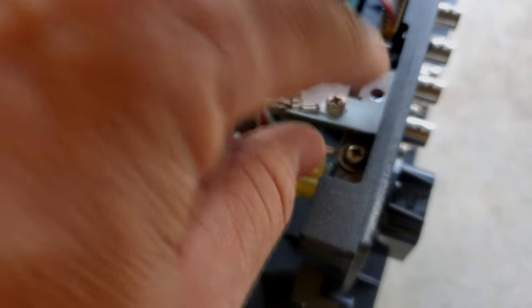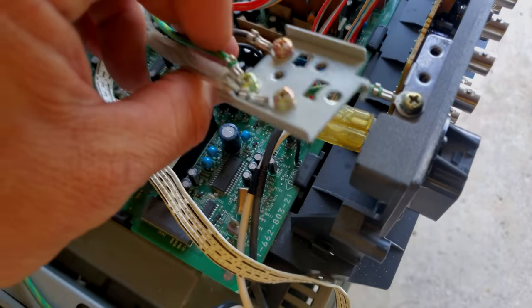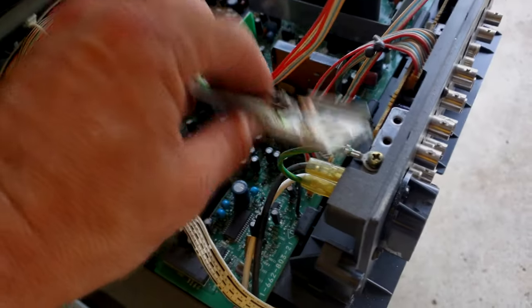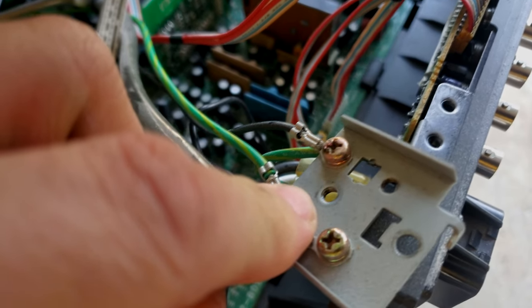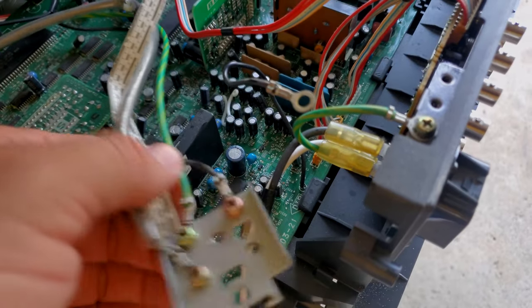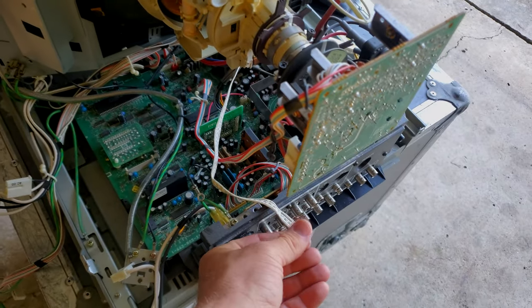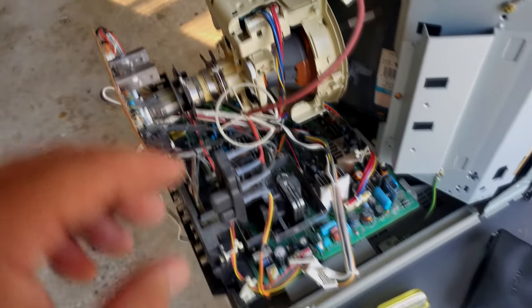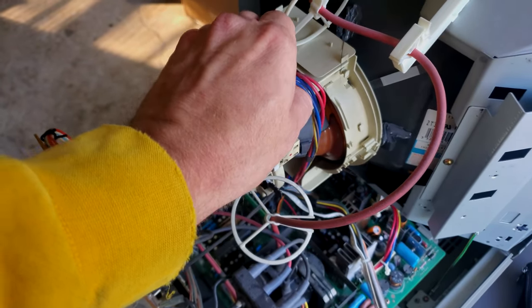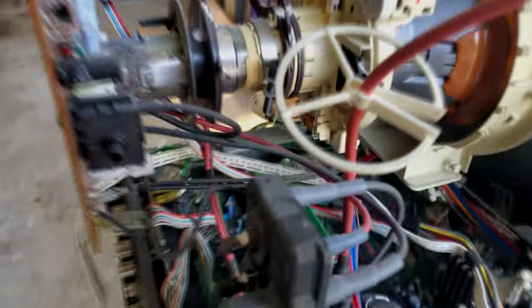Come over to this side and check out this grounding connection plate. There's one screw connecting that plate to the input board — you need to remove that so it's loose but stays with the tube. Then there's one ground point connected to the actual board — remove that single ground connection screw too. Next, make sure the yoke is disconnected — thankfully on this setup you have a yoke disconnection cable right up top instead of having to worry about underneath.